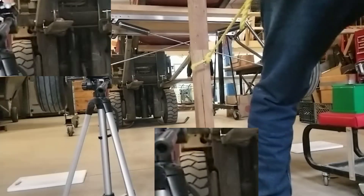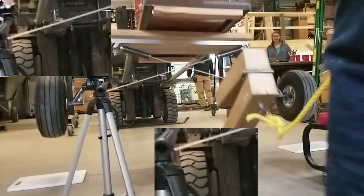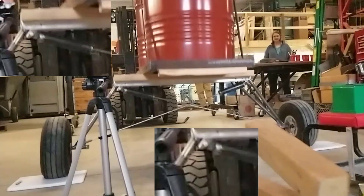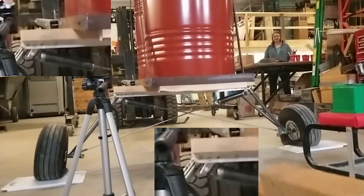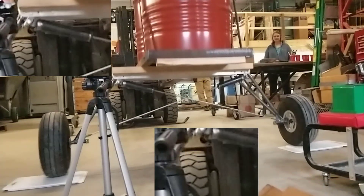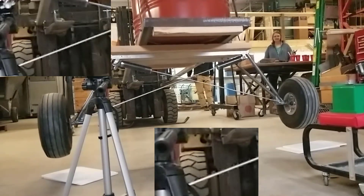I've shown three views of the drop test so that we can zoom in on the spring attach bracket and see how it reacts. As I pull out the breakable support, we get a fairly straight drop with the right-hand wheel touching first, simulating a real-world scenario. You can see as the drop rig reaches its lowest point that the bracket has stayed in place. As the rig cycles through the bottom, you can distinctly see the yield of the bracket. First rebound amplitude is about 40% of the drop height and secondary amplitude is 10% of the drop height.